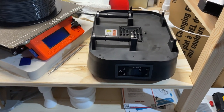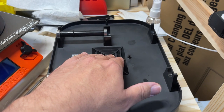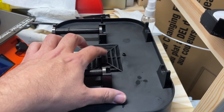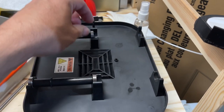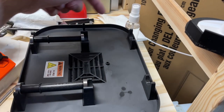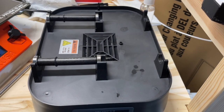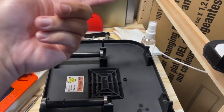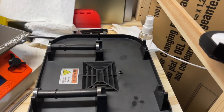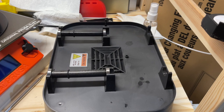Design flaw — big design flaw. I think it would have been better to have a smaller heater, one that maybe has to work a little bit longer, put it at the back, and have it blowing sideways. I think that might have been better, because that would have had a little convection thing happening rather than blowing right in the center, right on the filament. Because unless that filament is spooling out, that's just not a good thing.